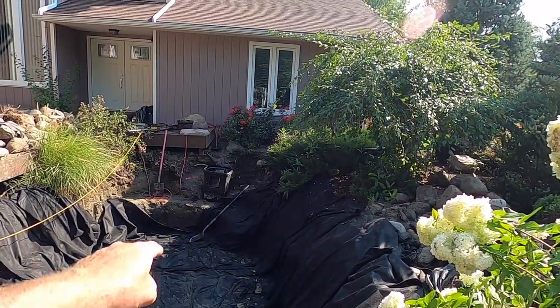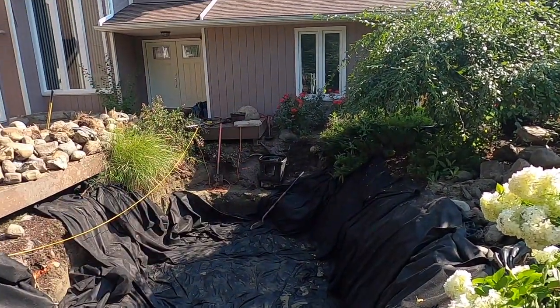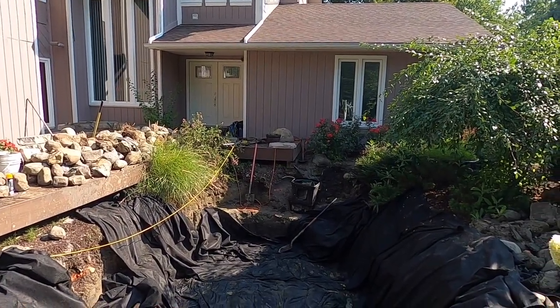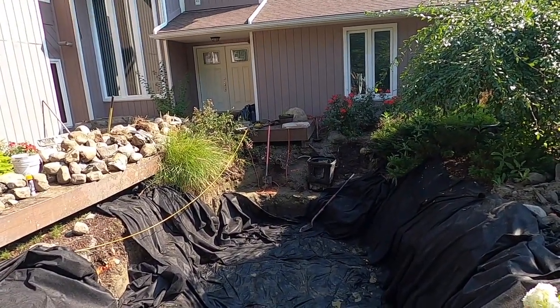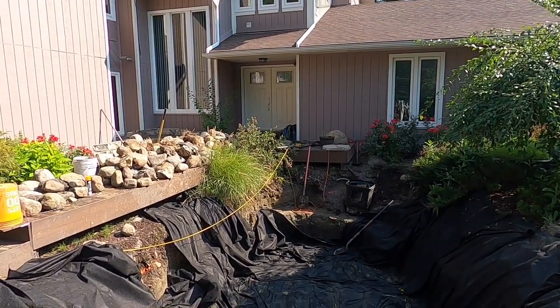What we're going to do is raise that skimmer up where it needs to be. Water level in the pond can be as high as possible. We're going to come up with another solution for a waterfall on that side. Opposite the pond where I'm standing, we're going to do a waterfall, a low profile like we always do. Have the water come back to the viewing area for the homeowner here.